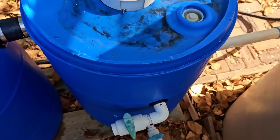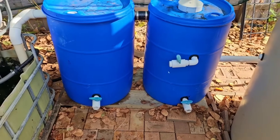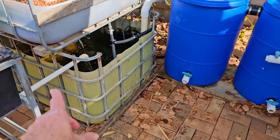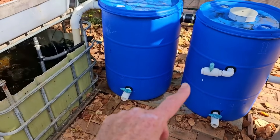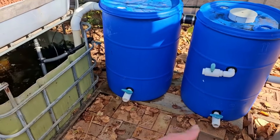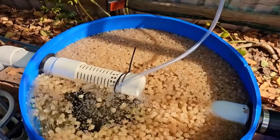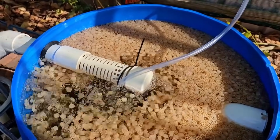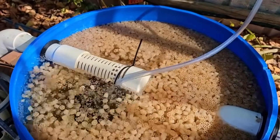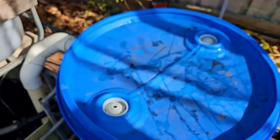The new solids lifting outlet is in there. The air is over the back side now again with the venturi, just like it was up the top. The pipe coming out into the solids lifting outlet is doing as expected - it's lifting solids into the settler. The settler could have been cleaned today but I didn't - I'll do that through the week. I actually need to source another length of PVC because I used that one and stole it from there, so I need to get another metre length so I can do my bleed off. In the moving bed bioreactor I've got the airline zip tied into the centre - it just seems to give it a better spread, but I do think I need to add some more air stones in there to get a nice even churning, boiling pattern.